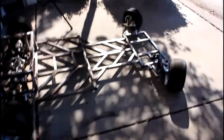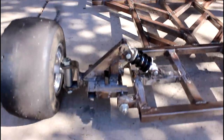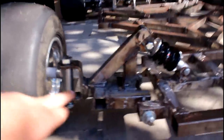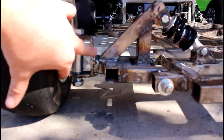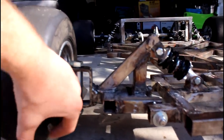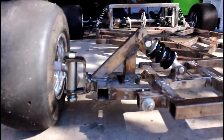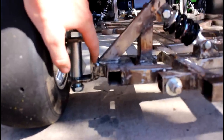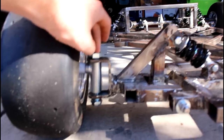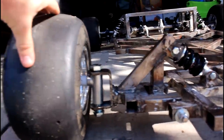I got the cart pulled outside since it's a nice sunny day to help the video. The first modification: this C bracket used to be mounted in about the middle, and now I moved it down — I cut it and re-welded it on both sides. I had to play around with both sides to make sure they're level, but I'm really happy I did this because I feel much better about these welds than the previous ones. I'm a lot better at welding now.